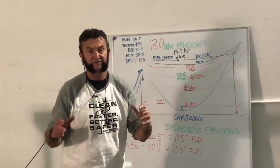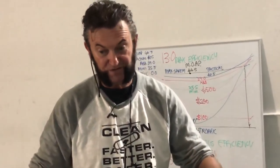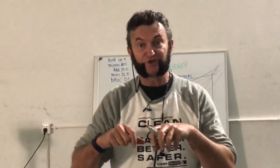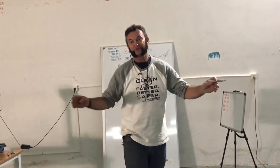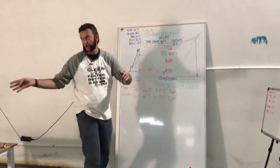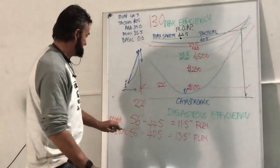Now, you've got to have the pole fully extended. For example, you could ask a reseller to make you a video of the pole that you're buying and say, can you do a 3-point flex for me? But you've got to make sure it's fully extended, because we've watched some of the tricks that they play. They might just not fully extend it, or they might take the number one section out and show you how rigid it is with just 2, 3, 4, 5, 6 or something like that. So you want to see it fully extended, because that's the pole that you're going to be using, fully extended, and with your extensions if you need to.